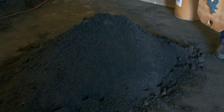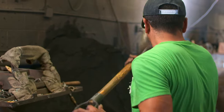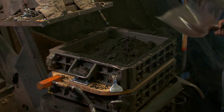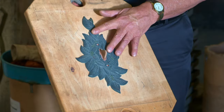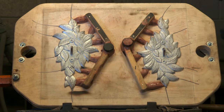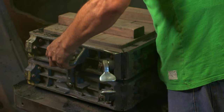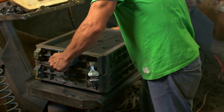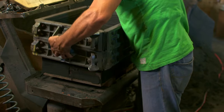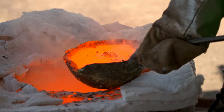The sand looks black as coal — it's black because the high temperatures of the metals turn into the sand. From Larry's carved wax, they make two patterns for production, apply a nonstick agent so the sand won't stick, then pack the sand tightly. He releases the two-part flask and Larry's door knocker pattern, created by tightly packed sand, is now ready for pouring.